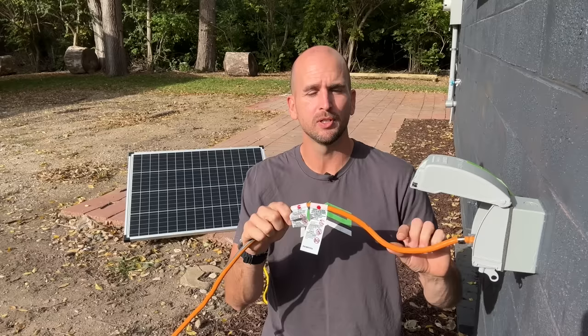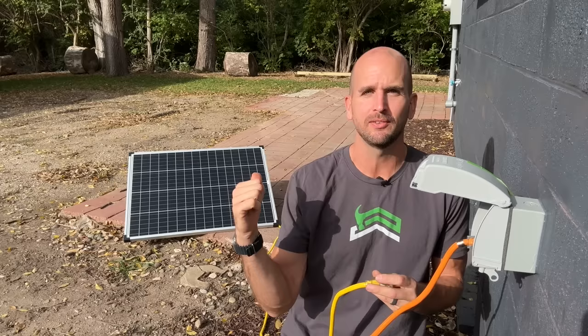For the last seven days I've been testing out a plug-and-play solar panel setup. I have four solar panels that are 360 watts apiece plugged into a microinverter that then outputs 120 volts that I can take right into an exterior outlet. It's not quite as easy as taking a cord directly from your panels and plugging that in, but it is about as easy of a setup as you possibly can get.